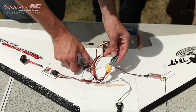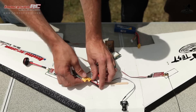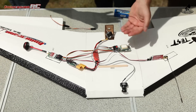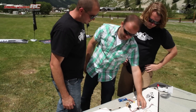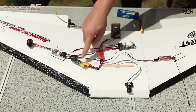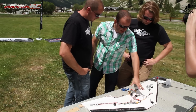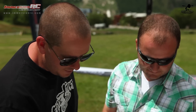For placement, you want to keep the OSD away from the transmitter, so position it somewhere up here. It also says on the sticker 'other side to sky' because the GPS receiver is on this side and needs to face up. You can mount it underneath a lid, just don't cover it with anything metallic. To make it clear: the signal from the camera goes into the OSD, through the current sensor, then into the video transmitter to your goggles. The easy OSD basically becomes the main central hub — it receives data from the current sensor and overlays all the information over your video.